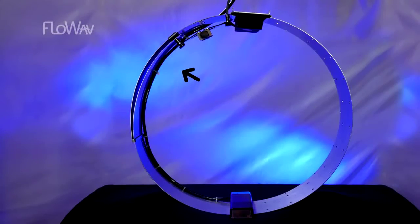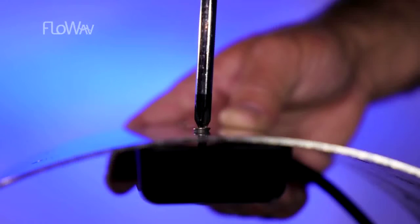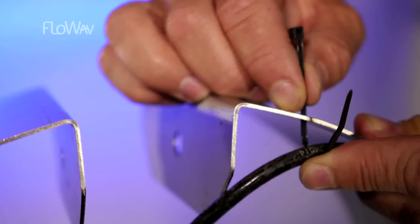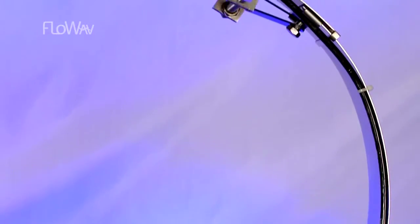The scissor assembly will need to be slightly offset from the top of the pipe so that the Stingray and the PSA AV can mount either directly on the 12 and 6 o'clock positions or slightly offset if needed. With that in mind, attach the PSA AV to the sensor jack ring using the same technique we discussed in our spring ring tech talk. Once the scissor assembly and sensors are mounted to the ring, you are ready to dive in and install the equipment.